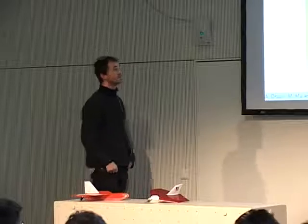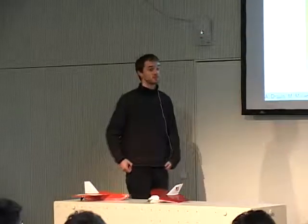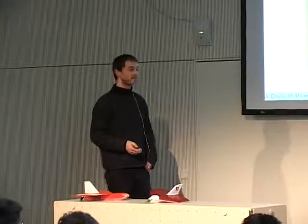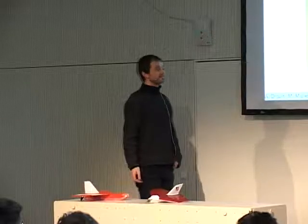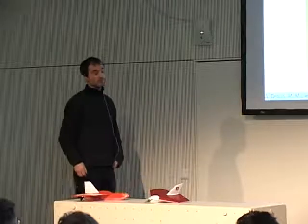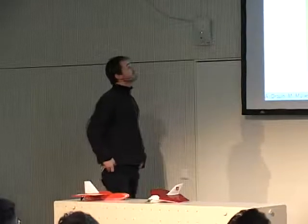And you don't get a direct reading from a gyrometer. You get only a rate reading, so you have to integrate that to get your attitude. So you need a fancy filter. This is complicated. In Paparazzi, on fixed wing, we use another way to measure attitude.